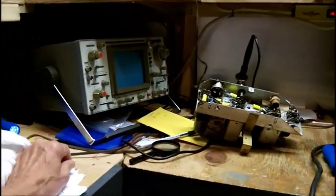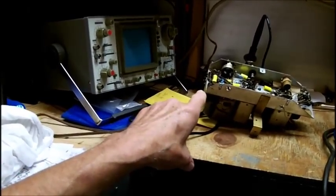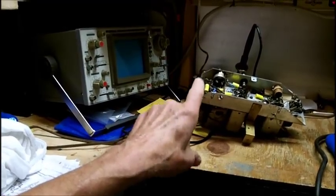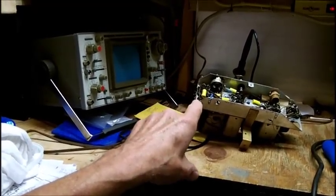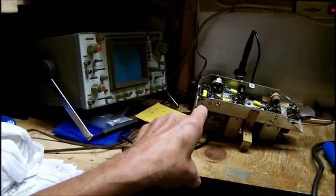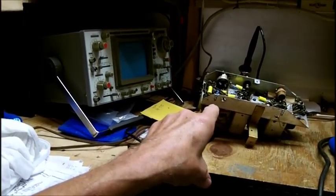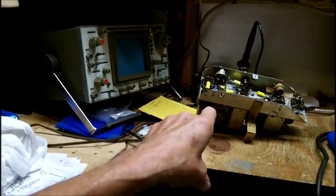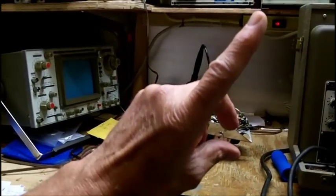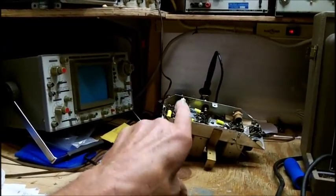So this radio — I'm going to get a 45Z5 tube in here. That was an excellent idea by one of the guys on the antique radio forum. I'm going to look the specs up. From what they say it's the same tube, just 10 volts more on the filament, which is great for high line voltage. I don't have high line voltage here — if we get 118 volts we're doing good.